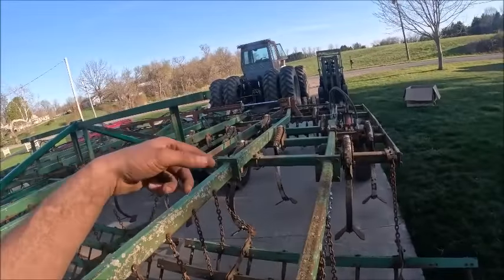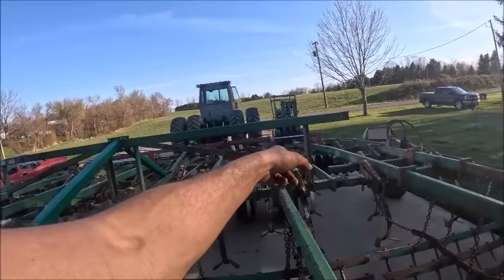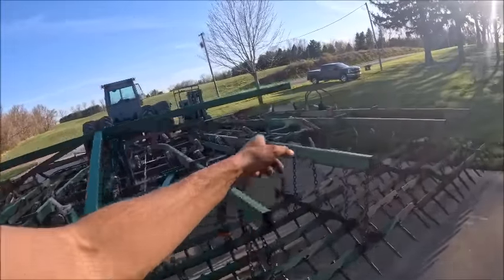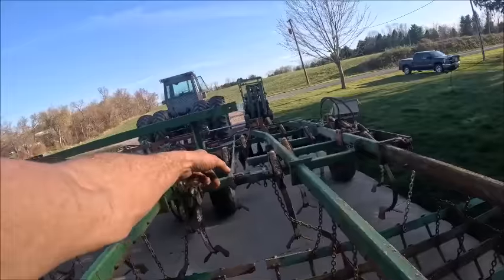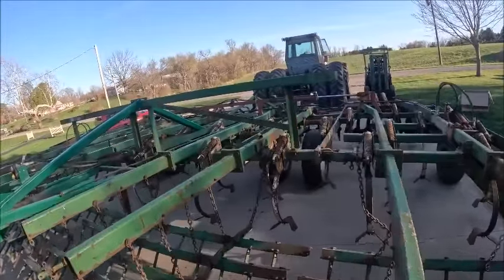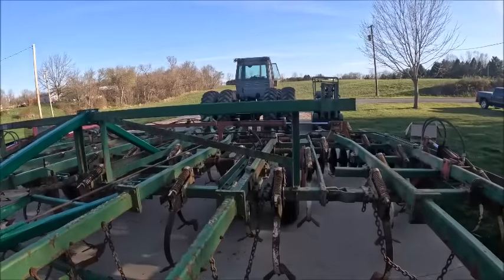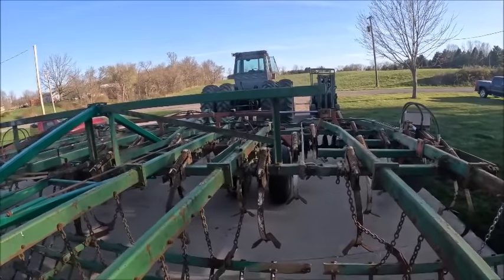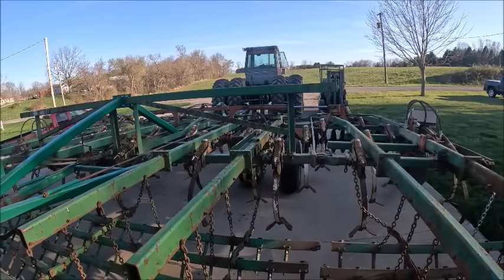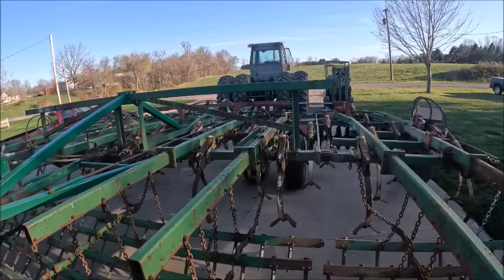Oh, and I got a tire. Which one? That one. Right? Yep. That one, we've got to change that tire, because the inner is chafing pretty hard right there, and I don't think it's very far from seeing cord. One of the downsides of a walking beam, although this isn't technically a walking beam, but one of the downsides of having wheels and tires in that arrangement.